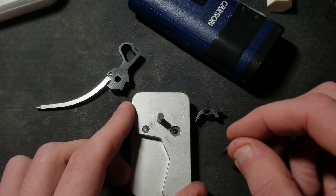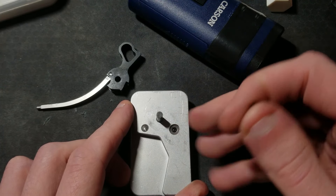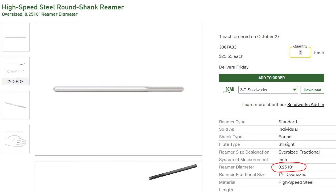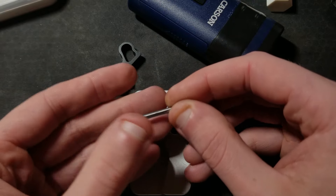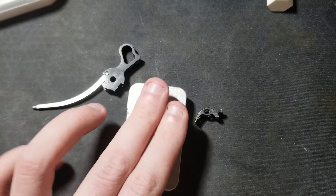Since there was already a hole there, the point of a drill bit would hit it and just walk all over the place, screwing up the location. So we established the new hole with a 3/16th end mill first, then used a letter C drill bit to create an undersized hole for a 2510 reamer. We reamed the hole out, which gave us a light press fit with a 0.250 drill bushing that has a hole of the correct size for my new sear pin. The new pin is a Z-plus tolerance 111 thousandths gauge pin cut to the correct three-quarter inch length. I had already fit a hammer pin to this jig — now I have two very tight-fitting pins.